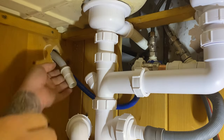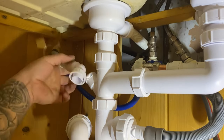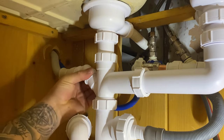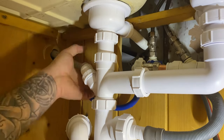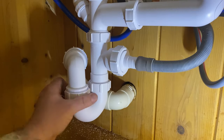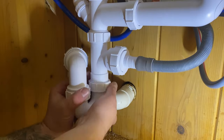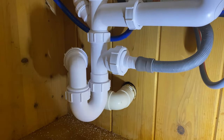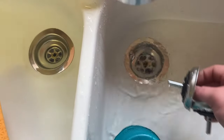Let's get on the utility — the washing machine appliance outlets connected. They're pretty easy; you just cut them down to make sure it's nice and tight when it goes in. These don't have washers inside; they're just a chamfered fitting. That's all looking pretty good — I think that's all of the connections made. Make sure everything is tight; go over every joint you've done and tighten everything as tight as you can using your hands. No tools. Then we'll fill up the bowl and let it go to make sure we've got no leaks.